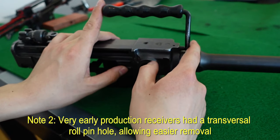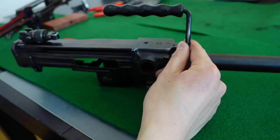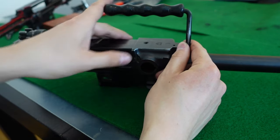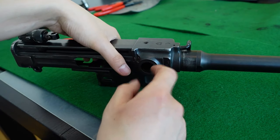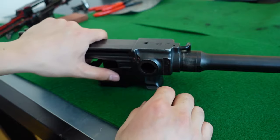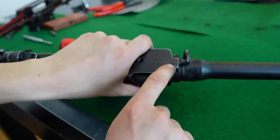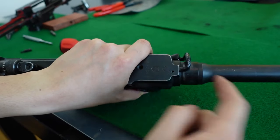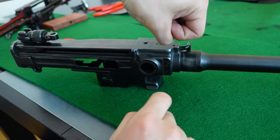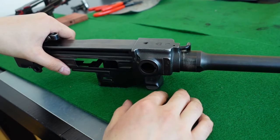There are two semi-official ways to remove the carry handle. One is to pound it out by slamming it with a mallet, which breaks the roll pin and allows carry handle removal. The other is to use a special tool called the Ausziehwerkzeug — basically an extracting tool where a tap threads itself into the roll pin akin to a corkscrew and you simply pluck the roll pin out. In reality this tool is rarely used.